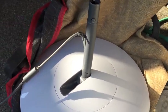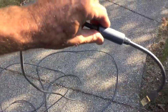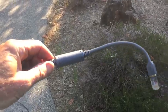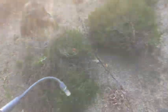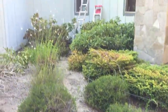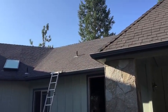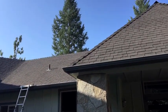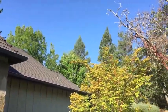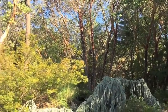Of course I'm going to mount it vertically so it's straight up, but it'll find its own satellites. It's got a kind of wide fitting that has to go on the end, so we'll just have to patch it after we drill the hole. They give you about a hundred feet of cable. It's just a matter of finding the right spot to put it up on the roof so the cable doesn't look too ugly. You can see we're surrounded by trees here — the dish likes the northern skies, so we want to make sure it has good clear access to the northern skies.